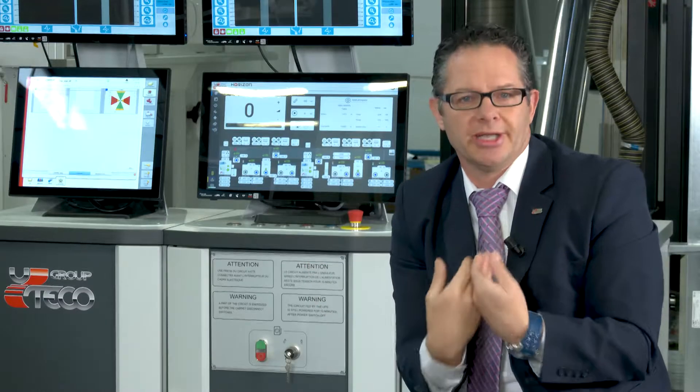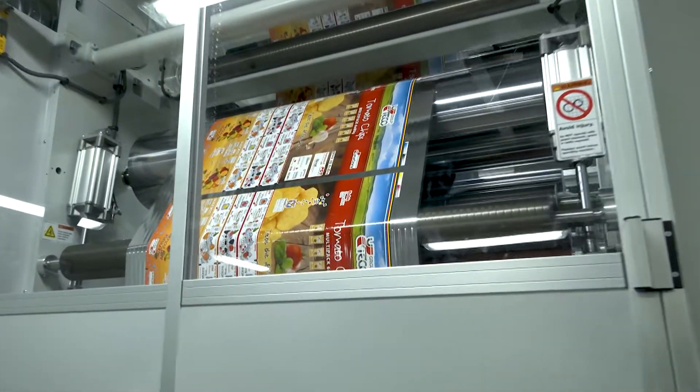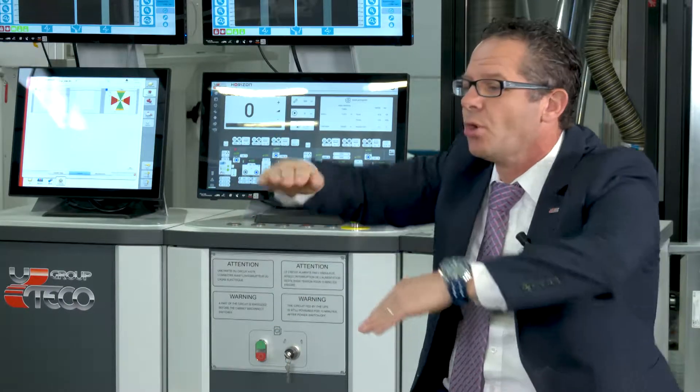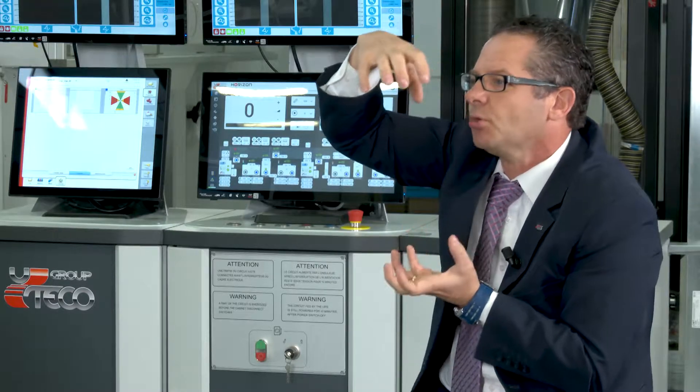The PTE enclosure is controlled by LEL — we monitor the solvent in those enclosures for the safety of the operator and the environment. What's also important is not just the coating stations, but the lamination part. The lamination is where you're bringing two materials together. You have to have stability of the lamination nip. We have two steel rollers and a rubber roller, independent and driven by AC motors. Old technology just had a nip roller with a roller on top, but we have two steel rollers on top and bottom to guarantee no deflections in the middle, giving better stability.